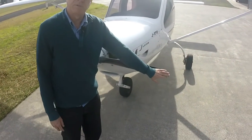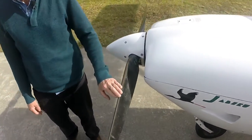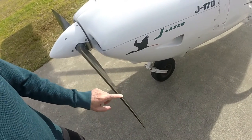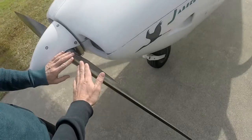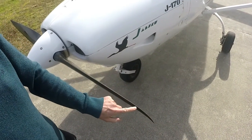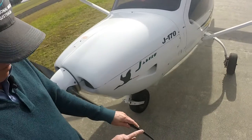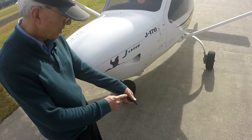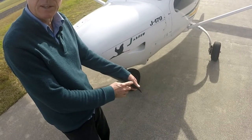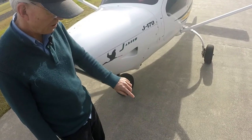We want to have a look at the propellers. Most of the damage is always going to occur on the leading edges and the back face. Have a good look at your leading edge — we're looking for impact damage from stones, anything hard that's been hitting, flying in the rain too much. You can see how up this end it's quite smooth, not much wear, and as you get down towards the tip it's a bit rougher. Right on the end we can see some little holes in the rubber moulding where it's starting to show inclusions. When there are too many or too bad, we fill and patch them. If there's only a few, just leave them because they'll continue to wear down.